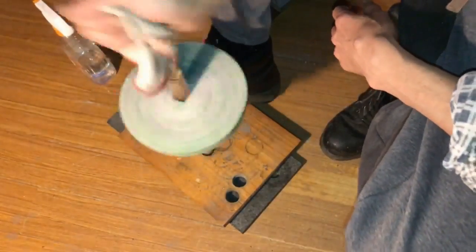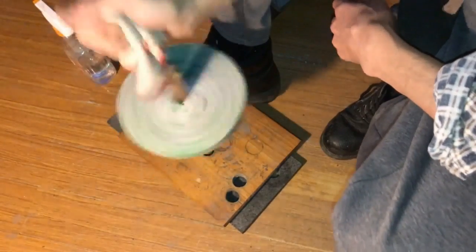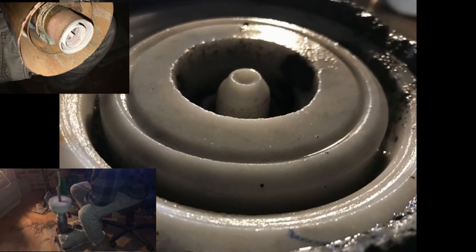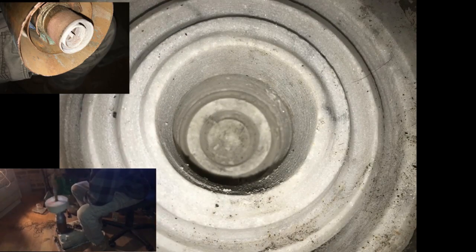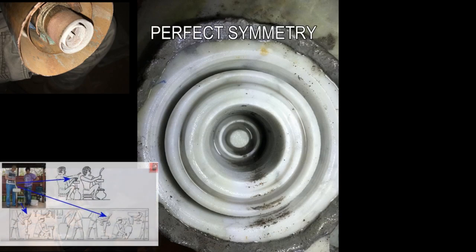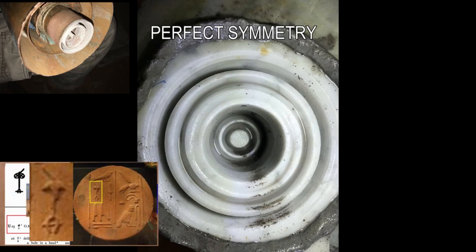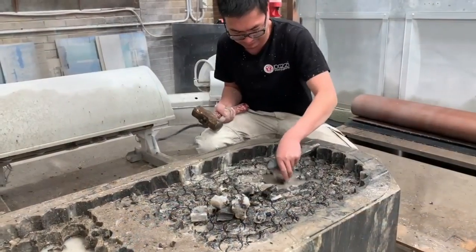This is a flywheel drill — the stonemason's drill. It works great; it compares very well to a modern tool except the modern tool uses electricity and I'm using hand power. You can see I got a four-inch tube starting to cut. It's not limited to small tubes — you can do it with a bigger tube with a bigger weight on there to help with the cutting speed. I've had multiple tubes, tubes within tubes within tubes, which add to the friction. When cutting stone with copper it's basically slipping over the top — anyone who tells you a copper blade gets wedged inside has never done it.